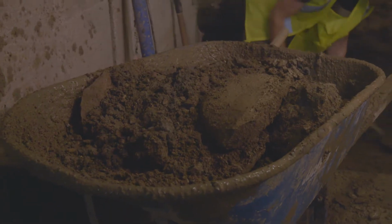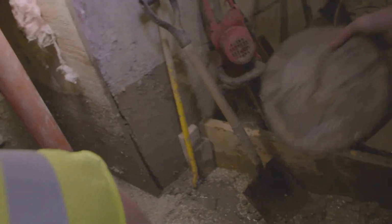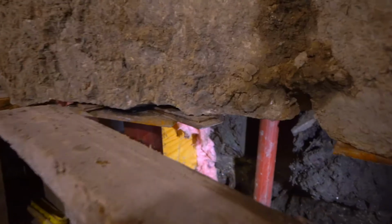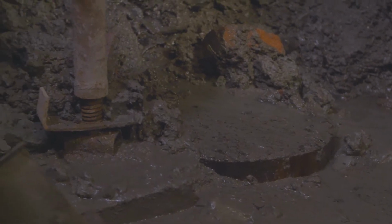But instead of just exposing them, we have to go down below the granite blocks that they're supporting. We have to get in underneath the wall to expose every pile that's beneath the wall. When we go in and cut these rotted wood piles, it's usually just the top 1 or 2 feet that's rotted, but we're cutting 4 or 5 feet because that ties back to getting to an elevation that's a few feet below normal groundwater levels and at least at the elevation or slightly lower than the deepest utility.